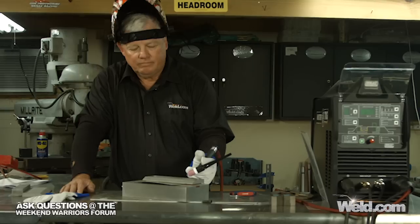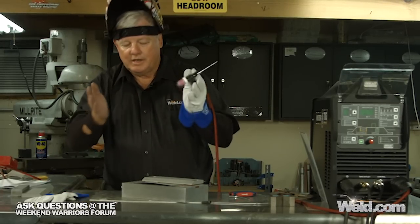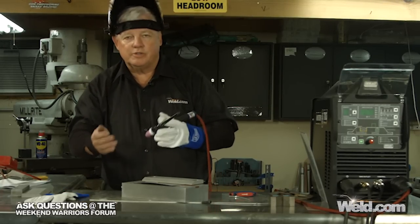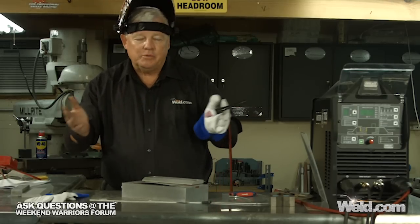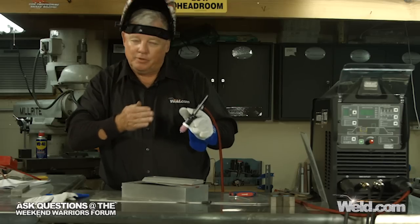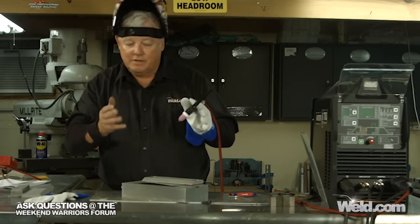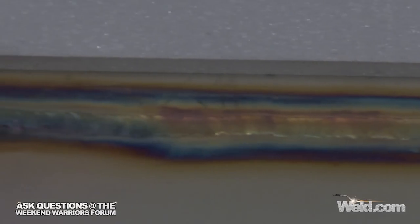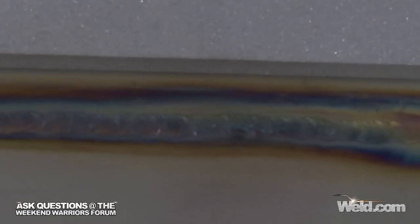Okay, now the weld was tightly focused with 500 hertz in there. Had I had no pulsing at all, the weld would have spread. It was still welded nice, but it was so focused, and you can't see the pulsing. You can certainly hear it. Sounds like a little bumblebee, but it just had very nice controls. You can see it just barely melted. Got good control all the way through.